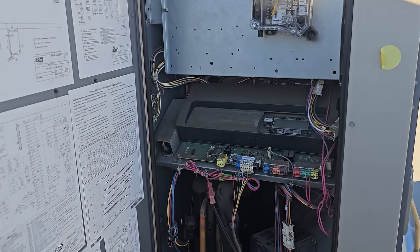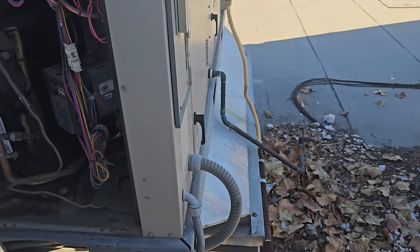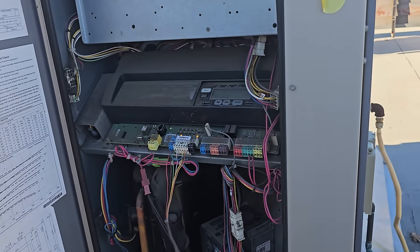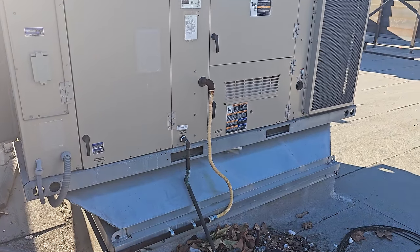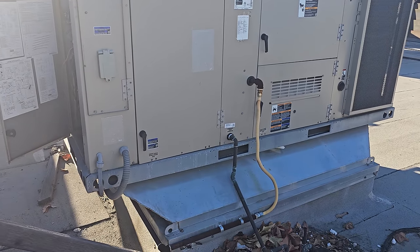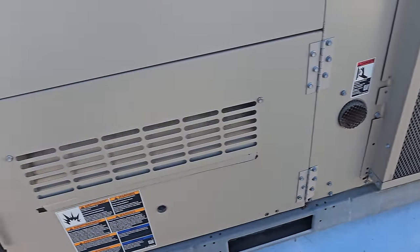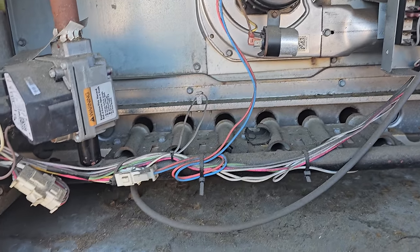At a minimum, they're getting a new thermostat. I had to go into the programming settings. This unit was installed by other people — not me — and they've had it for a couple of years. This has never been a problem before. My technicians are not in there changing the unit from gas heat to heat pump, and the manager doesn't know how to get that deep into the programming. So at a minimum, they're getting a thermostat — we'll put a Honeywell Vision Pro on there. It says morning warm-up, the inducer just turned on, and it should ignite in a minute. Combustion chambers are right here.